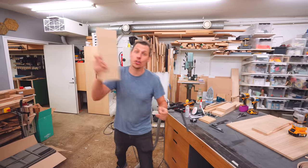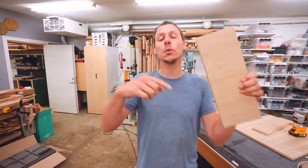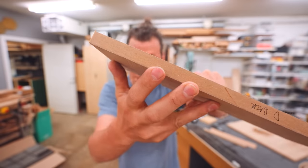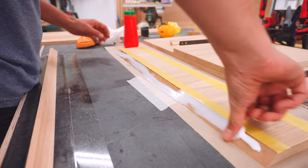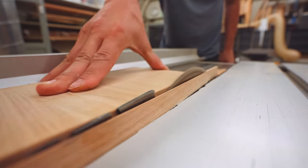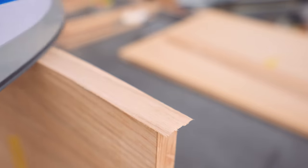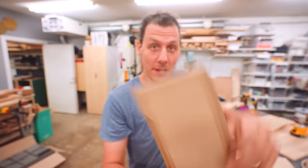Next, the drawer fronts for all the remaining drawers — just like the ones we made for the kitchen island, these are a fair bit of work. Starting with pieces that have matching wood grain cut out of the same sheet, I've split these up, and the next step is to router the finger pull groove in the drawer fronts. The problem is these fronts all have an MDF core. To solve that, I've cut a 45-degree angle on all the boards where the handle is supposed to be, planed down a bunch of strips of oak, and split those into 45-degree strips. I then glued all of those onto those same 45-degree edges, taking really good care that everything is the same thickness and lines up. Once the glue is set, we just trim off all the excess bits, edge-band the remaining uncovered MDF sides, and we're left with a piece that has one uninterrupted wood grain on the front and a top edge of actual oak into which we can now router a groove.